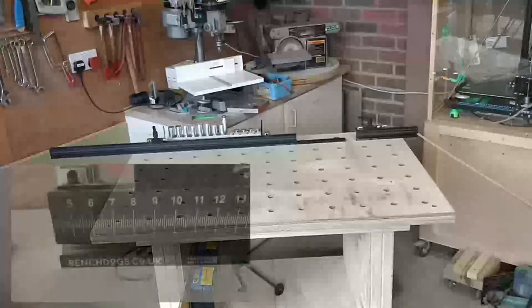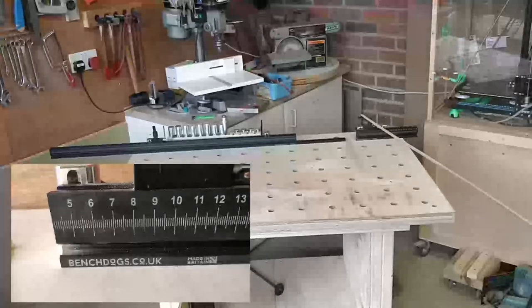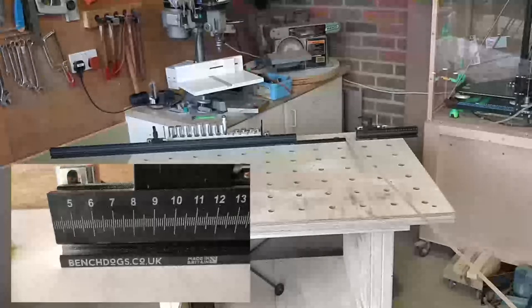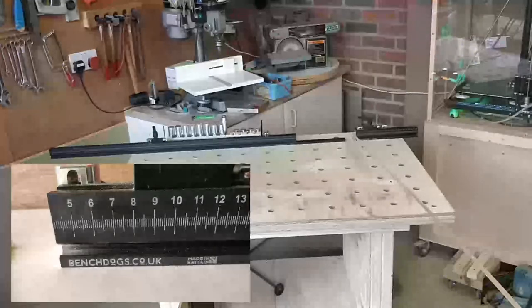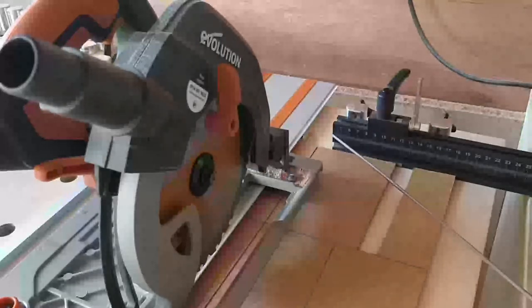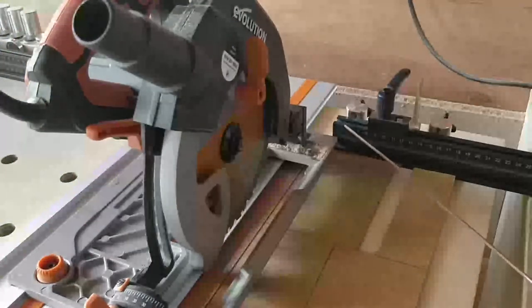This part here is the optional right-hand fence system. It also comes with a flag stop and the brackets to hold it to your MFT style tabletop. These are marked from 4cm to 29cm. The idea is the left-hand side of your blade should just be missing this, and the right-hand side of the blade should be 4cm away from the surface of this. Unfortunately, if I set this up so that the right-hand side of the blade — taking into account the curve — to here is 4cm, so that I can read off these numbers, then for the Evolution track saw, the fence gets in the way.